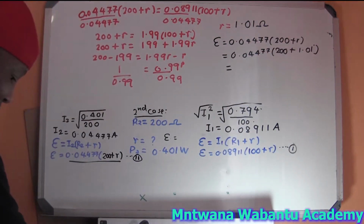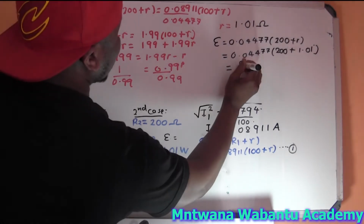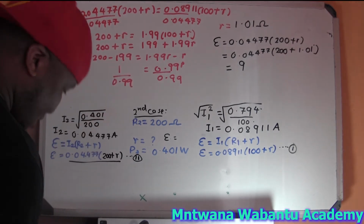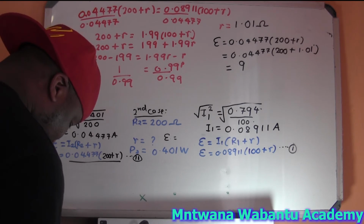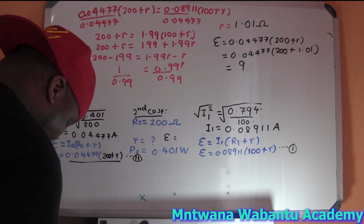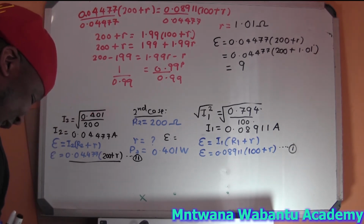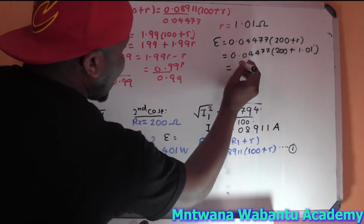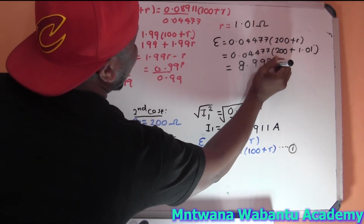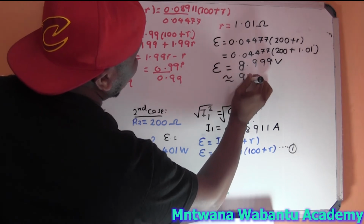And this is going to give us our EMF of 9.0. Let's see, 9.0. Yeah, it's 9.0. You plug in the calculator just to see, 0.04477, and the bracket, 200, and then we plus 1.01 bracket, and it's going to give us 8.99. So we get 8.9999999. So obviously our EMF, our voltage, if you approximate this, equal to 9 volts.